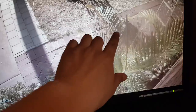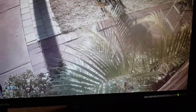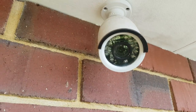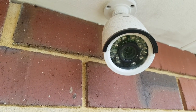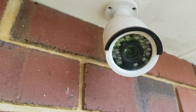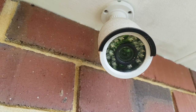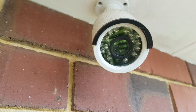If you don't have a problem with the cables, you can see the image is not very clear — it's kind of blurred or not very sharp. That means you should check the camera lens. The lens can cause camera blur if it's dirty from rain or dust. Sometimes spider webs, insects, bees, or flies can put stuff on it, which will cause the lens to get dirty.